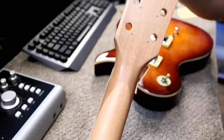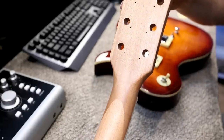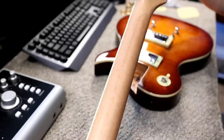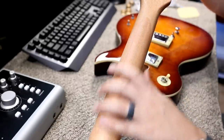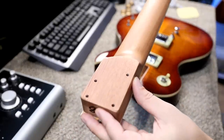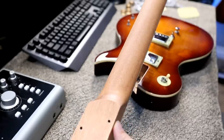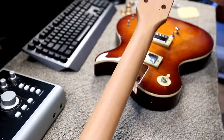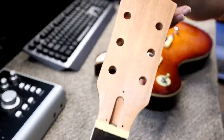It's a very satin kind of finish. Very nice, and I buffed it up with the sanding sponge there, 1000 grit, and it just made it very smooth. So it's not sticky at all, which is super important. And there we go. So hopefully you guys can see what kind of finish you could expect if you use that wipe on poly. But yeah, just a very satin look. So depends if you want high gloss or not.